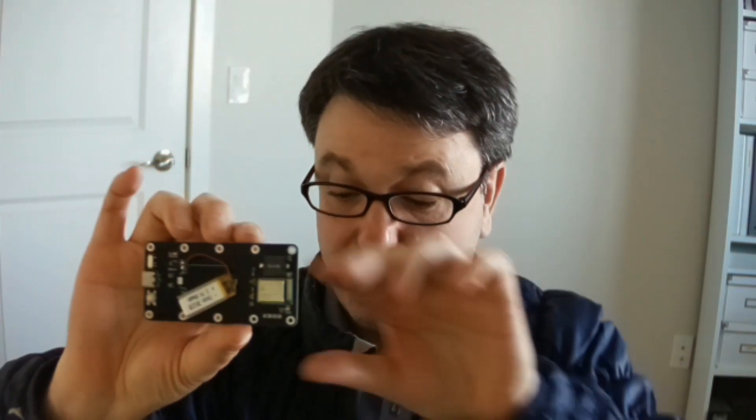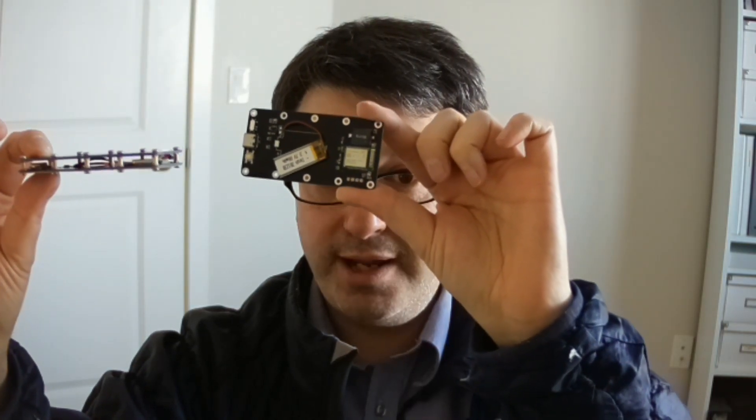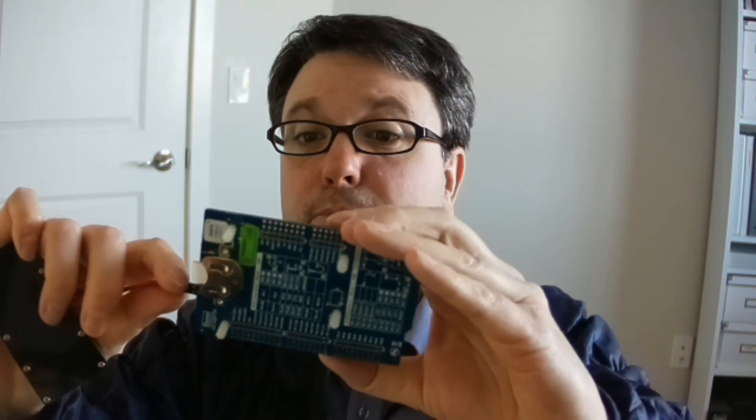Today I'm going to be working on a firmware power consumption benchmark. I have a brand new keyboard that essentially looks like this — this is just the keyboard plate, and this is essentially a Blue Micro that's been designed to fit that keyboard. It fits just like this, gets all screwed together, and then we have a full keyboard that is handheld. This keyboard has a little battery, but I've created another one where instead of installing a battery, I've connected a DuPont cable so I can plug it directly to my power profiler from Nordic.